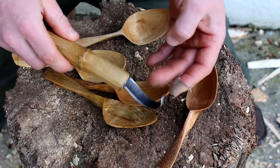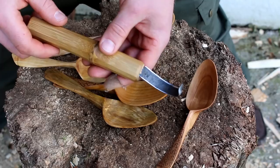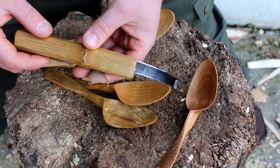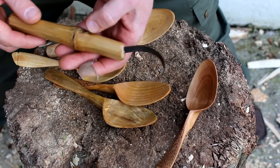If I haven't mentioned this yet, this knife is made from 1084 carbon steel, which is one of my personal favorite steels as well. I know that Reid is going through very controlled and conscious heat cycling in order to get very fine grain, so absolutely not a problem right there. Edge retention is great.